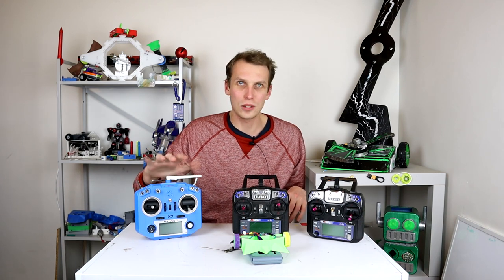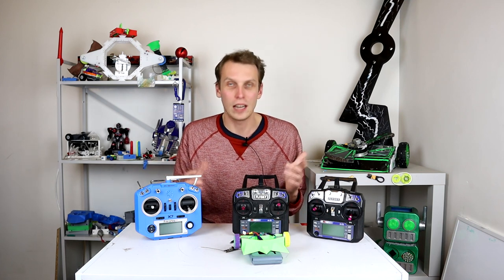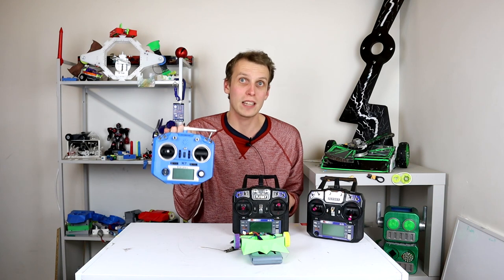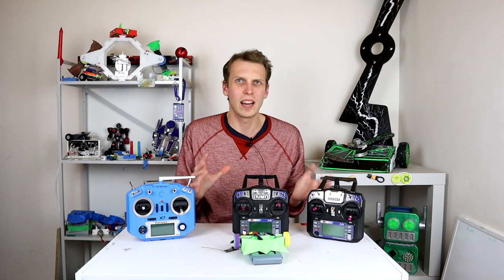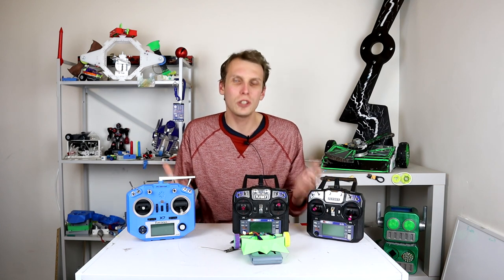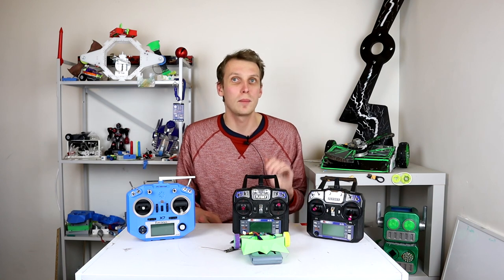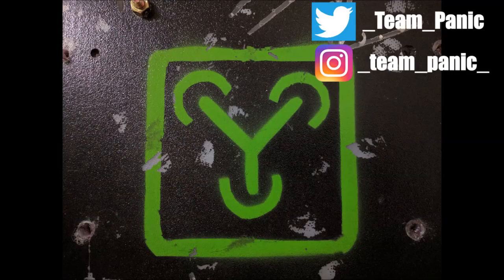The guides I found on this weren't as good as I wanted, so I kind of just messed around until it worked. If you move up to a new radio, try that channel 1 into channel 2 negative and channel 2 into channel 1 positive mix and see if you can shake it out. If you want to see more of this type of beginner content, please let me know in the comments. I hope you guys enjoyed this one and I will see you in the next video.